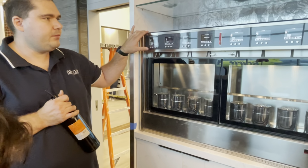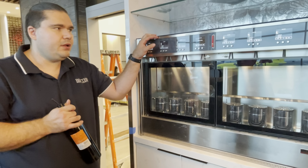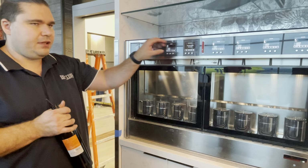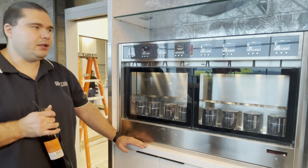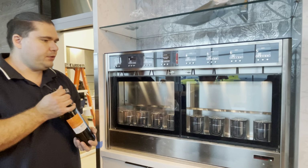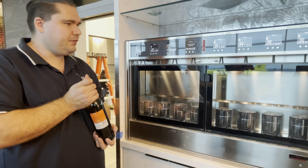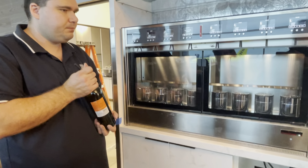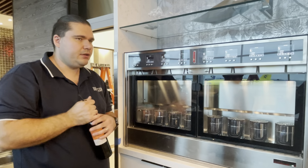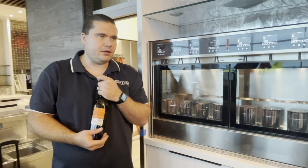The only other benefit of, well, there are 2 benefits of using the menu. Number one is that the machine kind of keeps track of it. So after about a month, whenever you put this card in to access the menu, it will say sanitation time on all of them. And that will never go away unless you use the menu to sanitize it. And that's pretty much the only benefit, is to make that sanitation menu go away. Other than that, it keeps track of it, so if you take a look in here, it actually tells you the dates of when you did the sanitation. Most of our customers only have two machines, so it's not usually that big of a deal to just keep track of it. Okay?